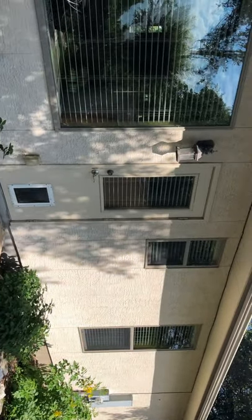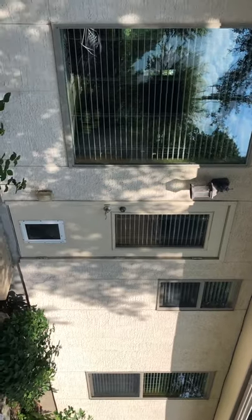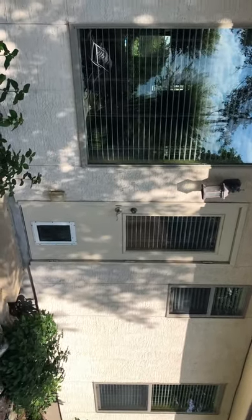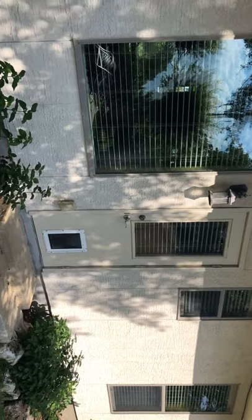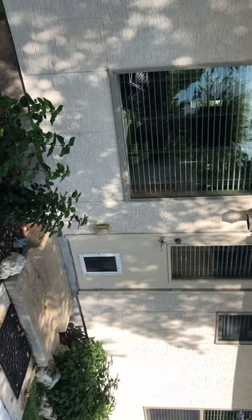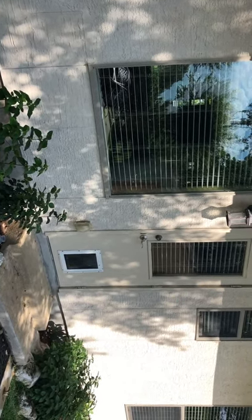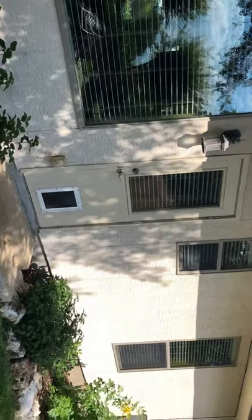We're doing this door as well. We're going to a full-view glass door with blinds in between — a Belleville — full replacement. All the brick mold around the exterior, the interior trim, the door, hinging, slab, threshold, and jamb — everything is going away. We'll put in the new door, and we will paint the outside and the inside to match as they are now.